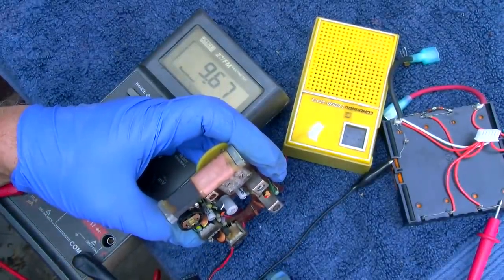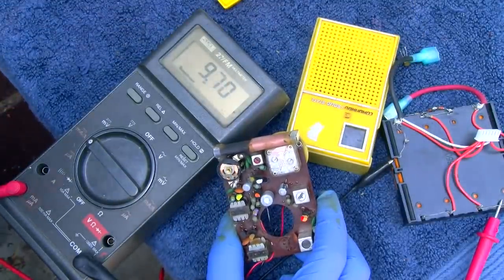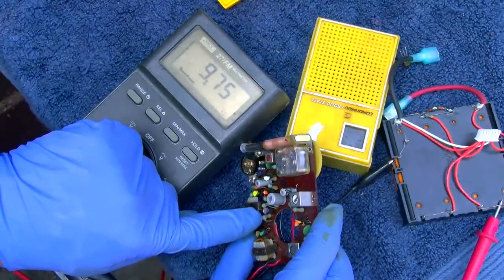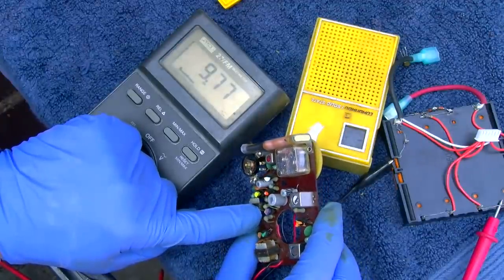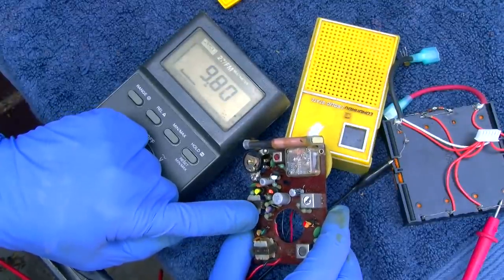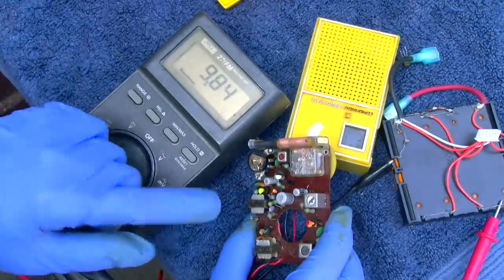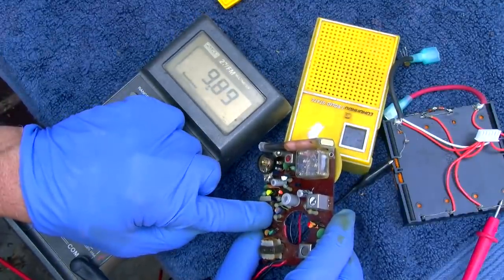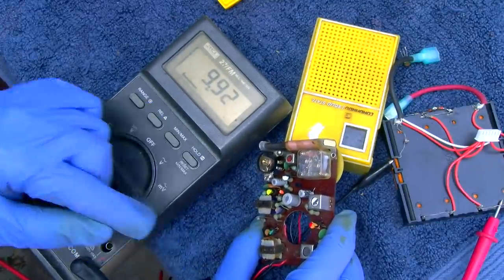The moisture is just causing bad transistors — definitely moisture intrusion. The bias control on this thing is literally one resistor and that transistor used as a diode. That transistor right there, the one with the purple, is in parallel with the output transistor. This is the bias network for this — it doesn't even use a two-resistor voltage divider. It's one resistor and a transistor used as a diode, and they're in parallel.